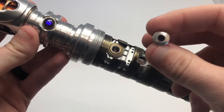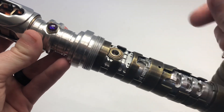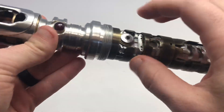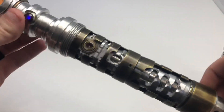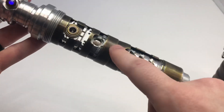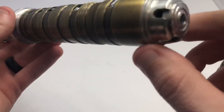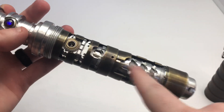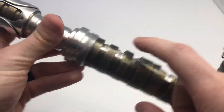I had this piece laying around — it fit the aesthetic really well. If you want, you can drill a little hole in it so you can do the twist method, but honestly it's just better to pop it out — you can get a fingernail in there and go from there. I drilled the retention screw right there. The bottom cap is attached to the sleeve and the speaker is attached to the inner core. You can pull this off completely if you remove the grub screw all the way. You don't need to pull this off unless you're updating the board — otherwise, all you have to do is have access to your recharge port right there.